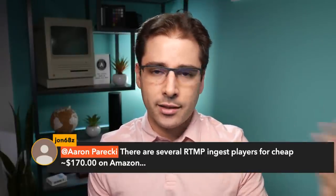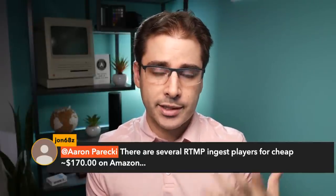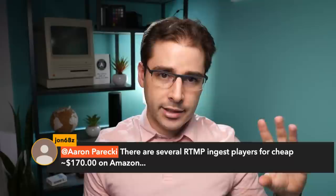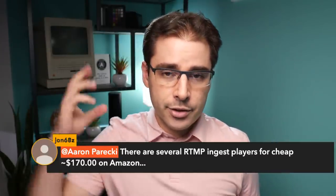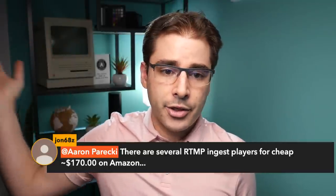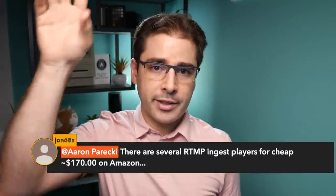So what I did on the Raspberry Pi was I set up Nginx with a plugin, the RTMP module, to turn it into an RTMP server. So then an RTMP client can push to it and an RTMP player can pull from it. Now, if you do that and set it up on a cloud server, you can use one of these cheap RTMP players because you can set that player to pull from that server.